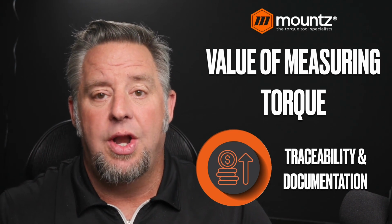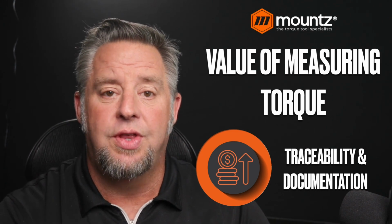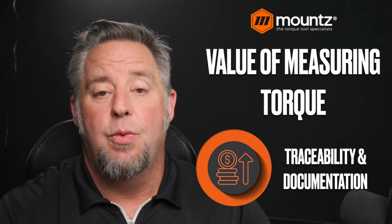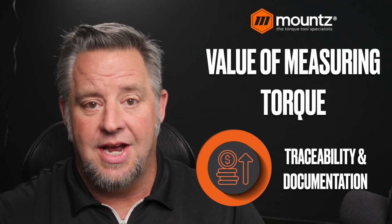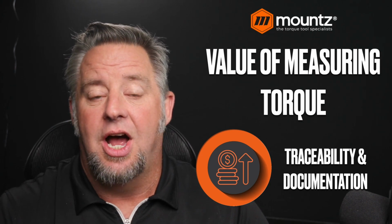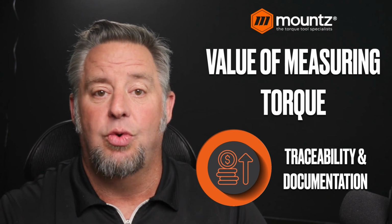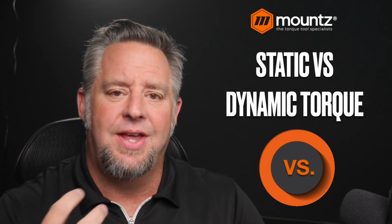The other nice thing about measuring torque, especially with a calibrated device, is the ability for that tool to have traceability to a higher standard within that testing process. With that, you also have documentation that you can use to help with maybe ISO 9001 requirements and certain other internal documentation regarding how your tools are performing in certain applications. By measuring the actual tool in the assembly process, this can give us really good documentation for that use.